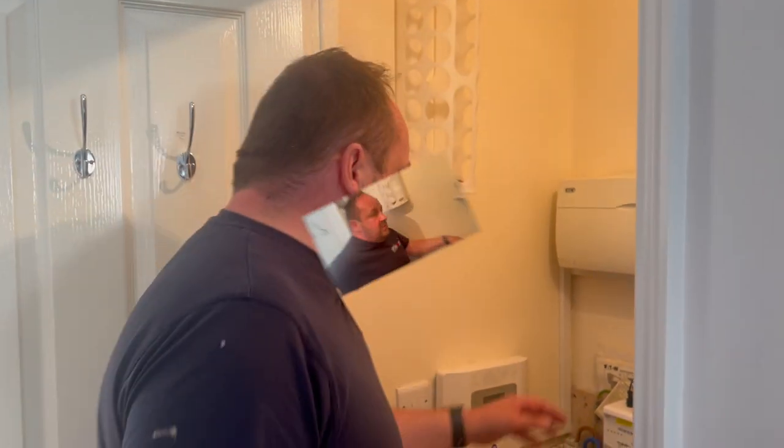The first thing we do is Ebbs takes a photo of the fuse board with it on and with it off. He also finds the water and gas shutoffs and makes sure we take a photo of that. Before we measure, the first actual test we do is disconnect the main earth — we disconnect the parallel paths — because the main thing is to make sure there's an earth to the house, and then we go on from there.